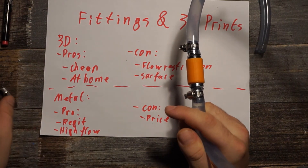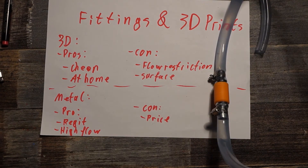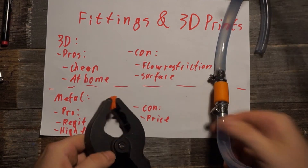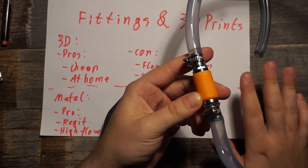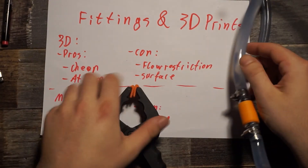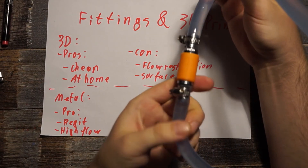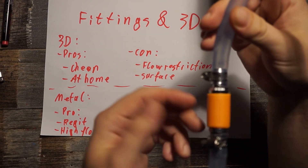It makes an actually tight seal. Now I'll start the pump — the water flow goes in this direction, and I'm going to clamp the flow off. Found the clamp. You can see there are no leaks right now, but there isn't much pressure yet. The pump I have here is about 50 watts and achieves 1.5 to 2 bar, which should be enough for most things. Now we clamp this off and... we still get no leaks. The PLA is tight, the fittings are tight, and this is completely without epoxy even.